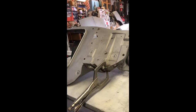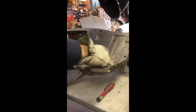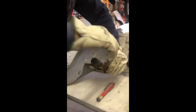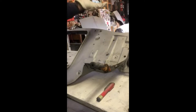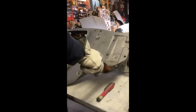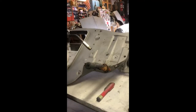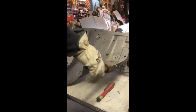Continuing to work the welding on this — there's an inner and an outer, you can see there's actually two pieces of steel, so I had to put a little weld build-up to close that back up. I'm using techniques I showed in a previous video: backing up your weld with a piece of copper when there's a hole. I've got about an eighth of an inch gap between these two panels that's gone, so I need to bridge that gap with weld. I'm using this copper spoon to cut down on burning up the edges of the two pieces — the weld doesn't want to stick to the copper.